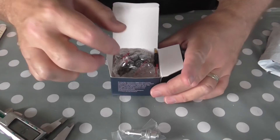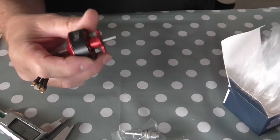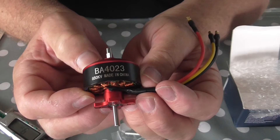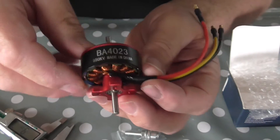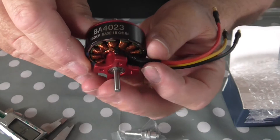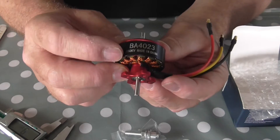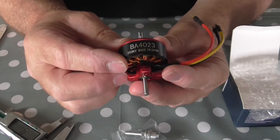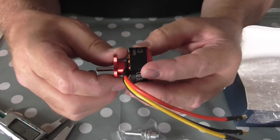I'm pretty sure that's the same as the Fenix motor. This one is an 850kV motor, and there we see BA4023 and 850kV. So 4023 is exactly the same as the Volantex motor that comes with the Fenix. All sizes of this should be the same, so it should be a direct fit. But it's an 850kV rather than a 1050kV — a little bit slower per volt, so you can put a bigger prop on. And it sounds like this works really, really well in the Fenix, so well worth a look.